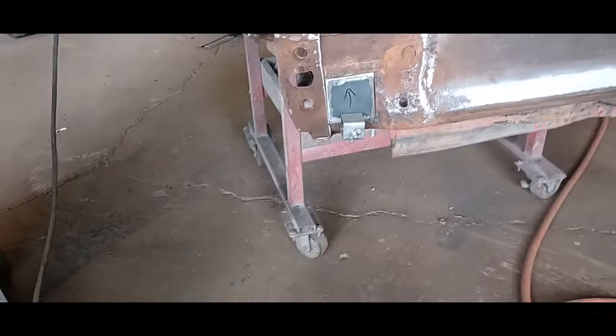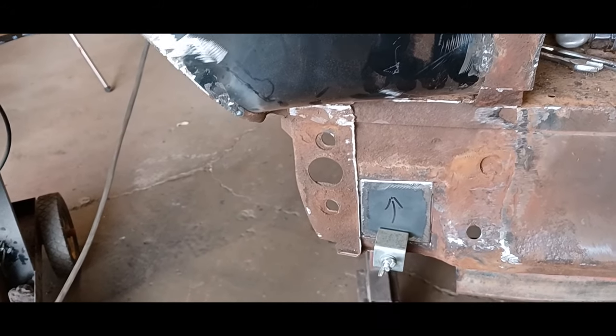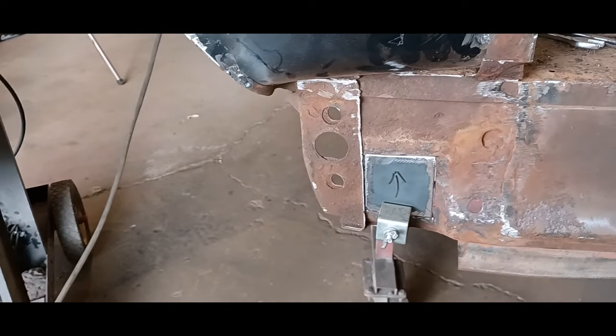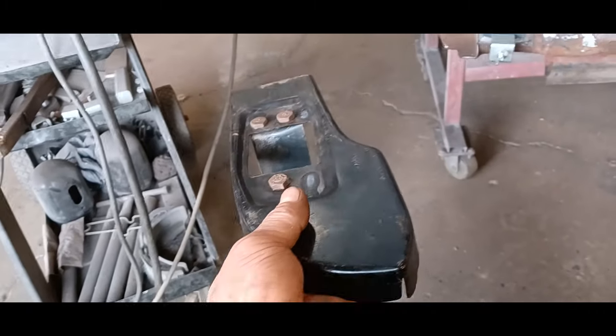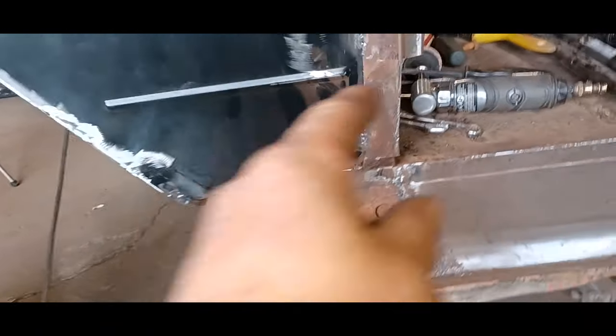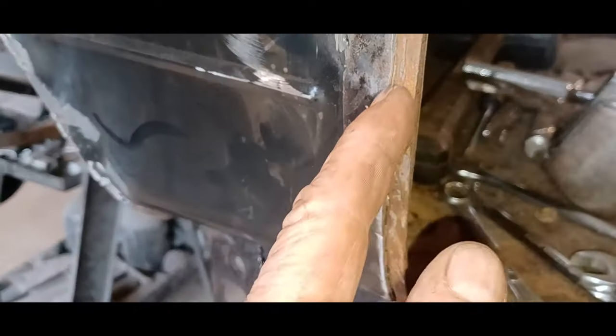Here's the small rust repair I was talking about. This is a little bit heavier steel than just body metal — it's basically 1/8 plate, it's pretty heavy — so that's what I'm patching it with. I'll get that welded in and then we're gonna work on getting this piece lined up. What I've done is cut down to the bottom of this piece, peeled off this little outside strip, trimmed my other piece leaving that little strip, and cut this chunk out and removed it.